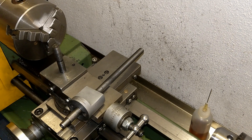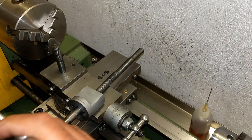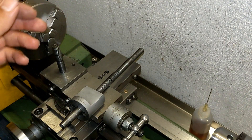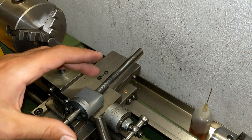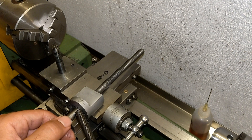Welcome back! In a previous video I showed you how I made a feeder screw, and the point of making this feeder screw was to make it slightly longer so it allows me to pull the cross slide slightly further back, and also I can place a thrust bearing on this end.